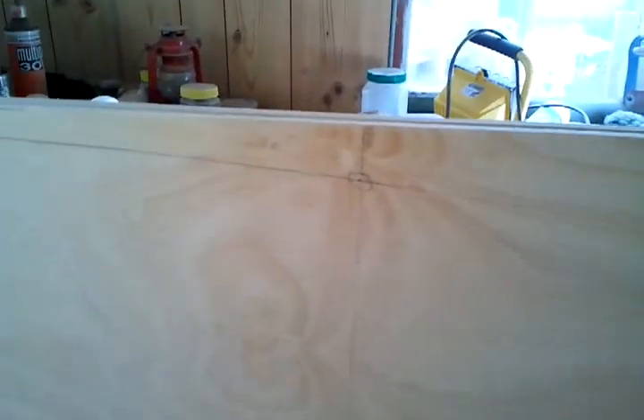I've spent a few days — and I'm not sure if you can see the pencil marks — but I've marked out lots and lots of shapes on the ply in pencil at full size. This piece in particular has got the stem down this end and two seat longitudinals back to back. Over here, this has the first 2.4 metres of the hull bottom — actually that's the stern. You can see marked out there's 300, 600, 900 millimetres off the plans; the offsets were all drawn. You can see where the intersections occur at the offsets — there's a little circle around the dot — and you get a nice flexible batten and join the dots.